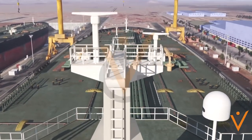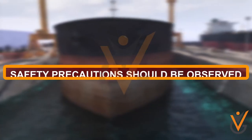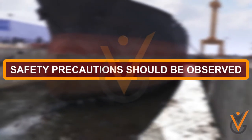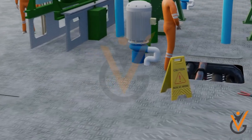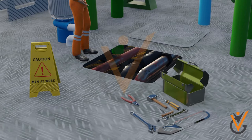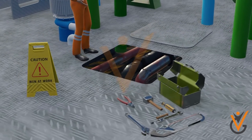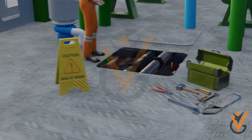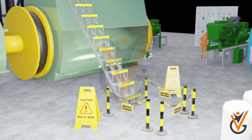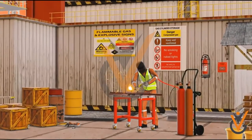During the dry dock, major repair works are undertaken for smooth running of the ship. The following safety precautions should be observed while the vessel is in dry dock. Many machineries are removed from place for overhaul. To facilitate this, floor plates may be removed. Temporary barriers should be put to prevent persons from falling. Guards for staircases may be removed, so safety signs and barriers should be provided to warn and prevent persons from using the stairs.